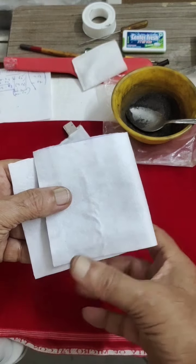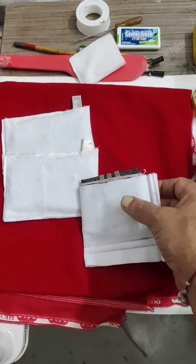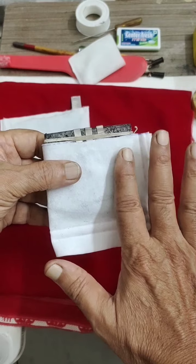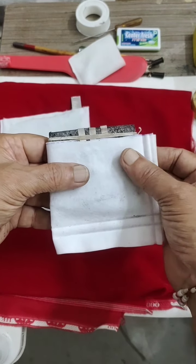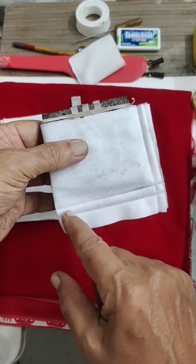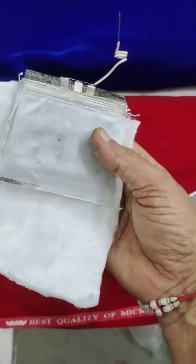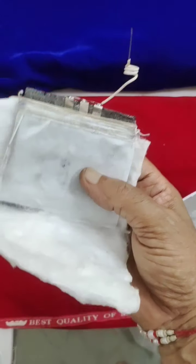Now I will just close it. After pasting the carbon, graphite and MnO2 over the graphite plate, the positive plate, the polyester cloth you saw, I have sealed it. You are able to see? I will cut those extra things. This will be my positive. So I have soldered all this and put a terminal wire also.